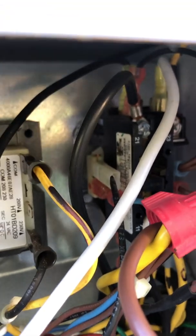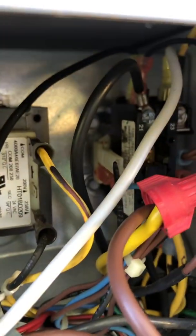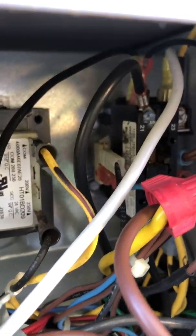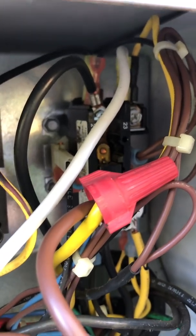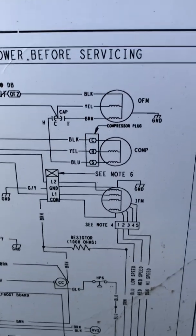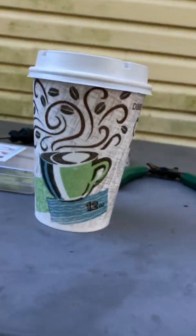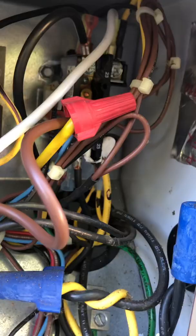Black goes to the common. We see the black coming off the pigtail goes up to the common contactor side, and then the white goes to the run contactor side. If you have any confusion about what colors to use, check your wiring schematic — it tells you black = common, yellow = run, blue = start. That's already labeled for you, so you don't have to do any analysis on the compressor.